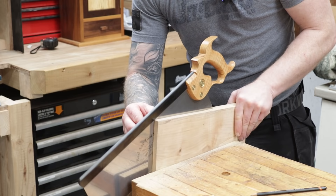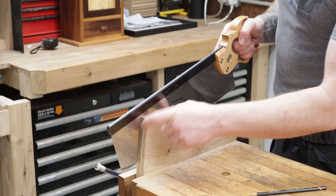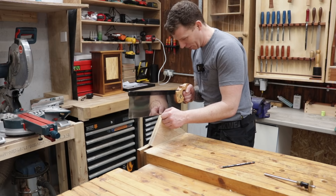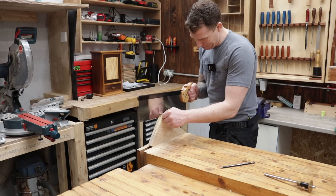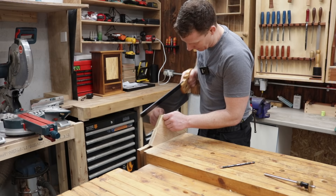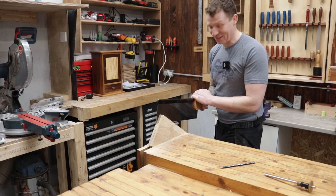Once I've reached the depth of the saw's spine I straighten it up in the vise and continue down the other side. We have two lines to keep the saw nice and straight. I just continue around the board joining up the corners, making sure all the cuts are lining up. The board is pretty punky in places — it's spalted beech, very soft in spots — but the saw is tracking pretty true. It's an absolute pleasure to use.